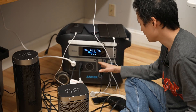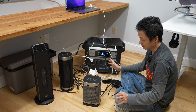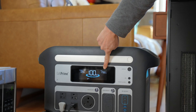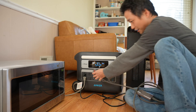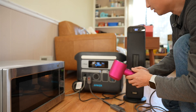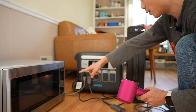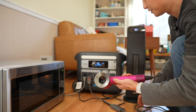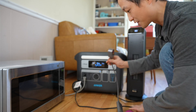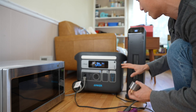It cuts off now as a built-in safety feature. It handled three heaters — that was amazing! Let's run a test with the microwave and a heater at 1800 watts. Now let's plug in the hair dryer. The hair dryer cuts off, so it can keep the electric heater and microwave running at the same time but not the hair dryer. This is a cool design — instead of cutting off everything, it cuts off just one port that exceeds the 2400-watt rating. The two remaining devices are running fine with no interruptions, pulling 1614 watts.